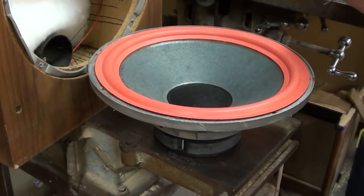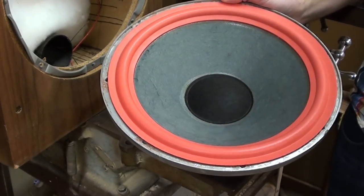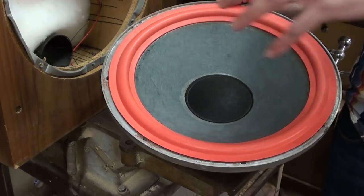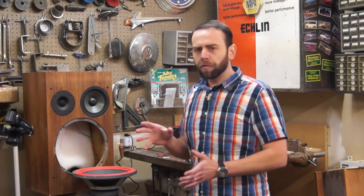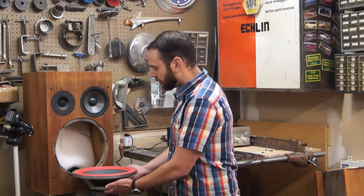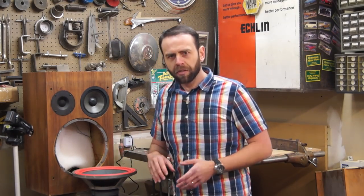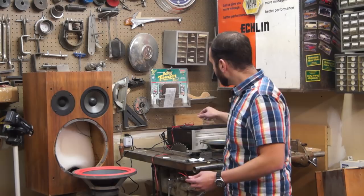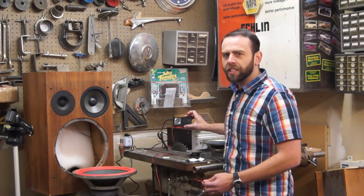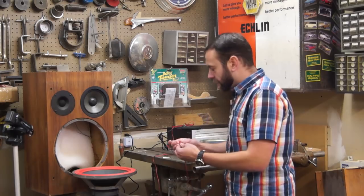When it comes to gluing on the outer surround, there are a few different approaches. One is to cut away the dust cap, stick shims in around the voice coil, and then glue the surround in — that ensures the voice coil is perfectly centered. The method I use involves playing a low-frequency test tone through the speaker, then gluing the surround on carefully to make sure the voice coil doesn't rub. I've got an iPod here — you can use a smartphone. Get a low-frequency sine wave at around 30, 40, or 50 Hz; I'll be using 31 Hz.